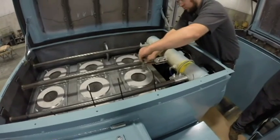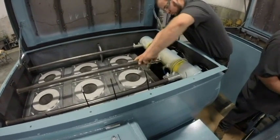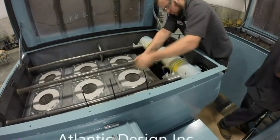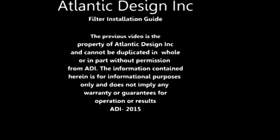After removing any trash, hardware, or tools from the filter deck, you're now ready to completely release the door braces and shut the dust collector door, making sure you or others are out of the way. Bolt the door shut and tighten securely, and your filter installation is complete.